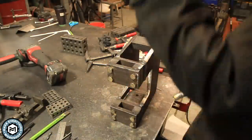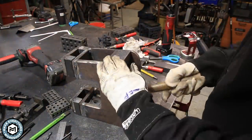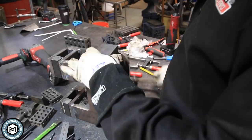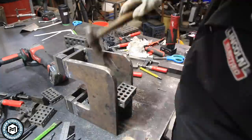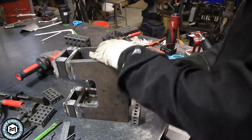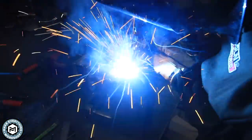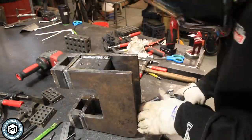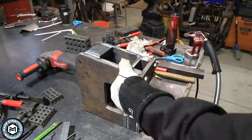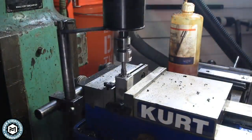I sunk a lot of heat into this piece and added a lot of steel because I wanted it to be super heavy, really robust, and last forever. There's another little plate I had to grind slightly so I could wedge it in — this piece lives on top. All these pieces are going to help stiffen the whole thing up. There's really no strain on the guillotine itself because the top tool floats through the guide, but I wanted to make sure this stays nice and sturdy if it ever gets hit — you don't want to bend that frame.